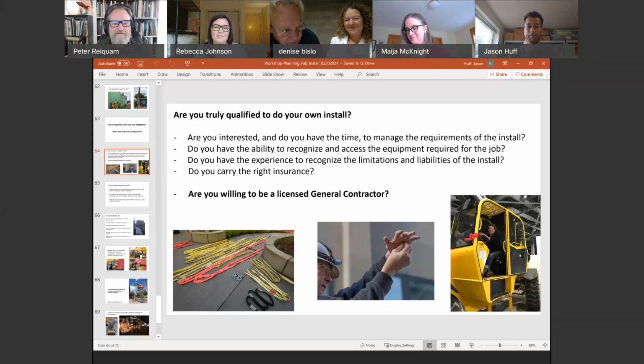One thing I want to add to what Peter said is, learn to read blueprints. It takes years to learn how to read a blueprint pretty effectively, but you can get the gist of it. Along with that, a very important thing to learn to read, even with your engineering, is the specifications that the engineer will put on your engineering, or the notes that an architect will put on the blueprints. There are often very important details specified for that particular area of that big piece of paper that you'll need to pay attention to.